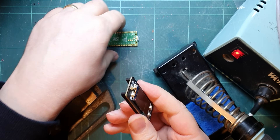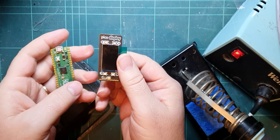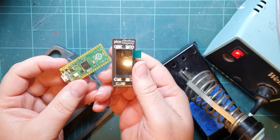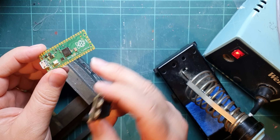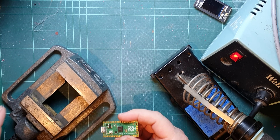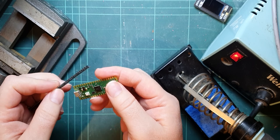I'm going to work on this Pimoroni Pico Display - I'm looking forward to this. But first I've got to solder some headers onto one of my Pi boards, so let's just get that done. It says to use this I've got to have the header pins pointing down. I'm gonna do some old-school soldering - I've got my old Weller soldering iron out.